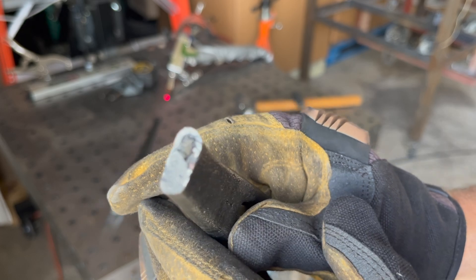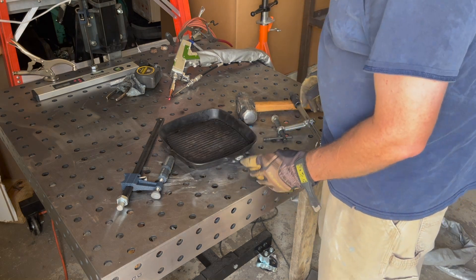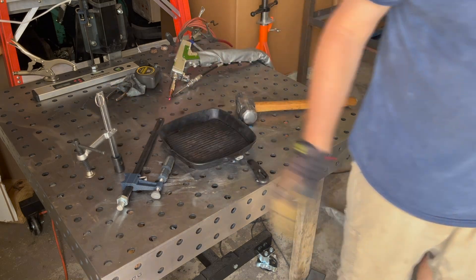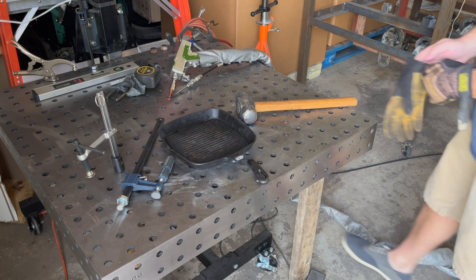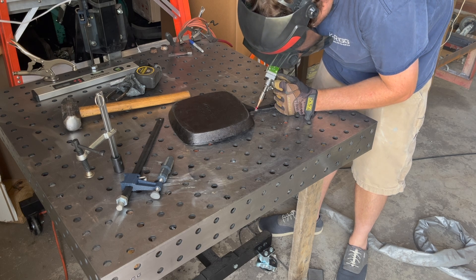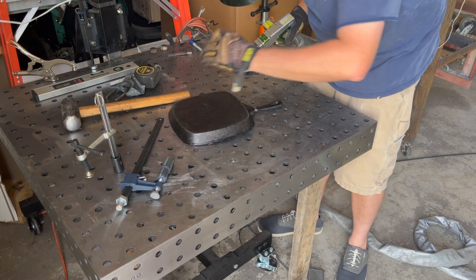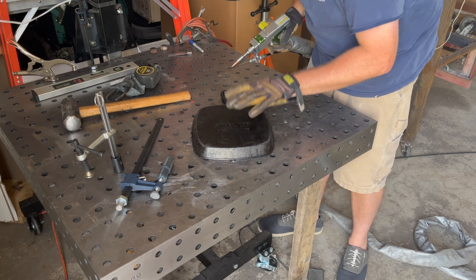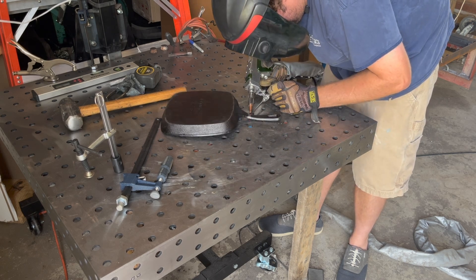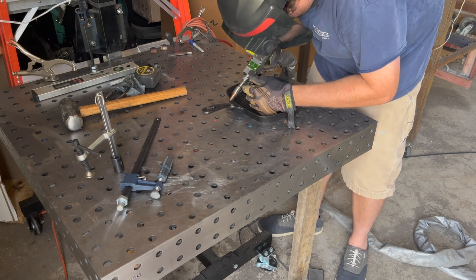Oh, it's hot. That's pretty cool without really preheating and just going after it. I could probably turn up my heat some - I want to re-weld it. That was at 550 watts, let's go to 650 for more penetration. Same thing, just a no-wire pass - I'm thinking that kind of does a good job of preheating it and then cleaning whatever's off.